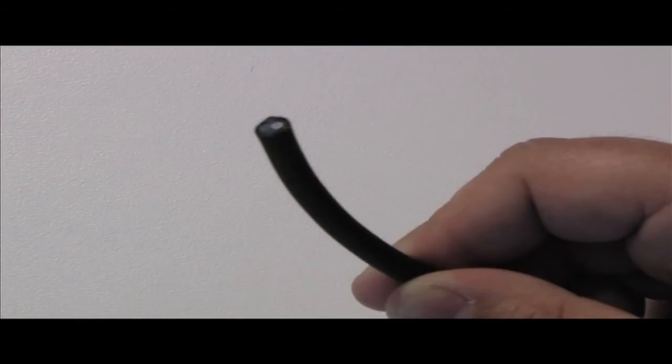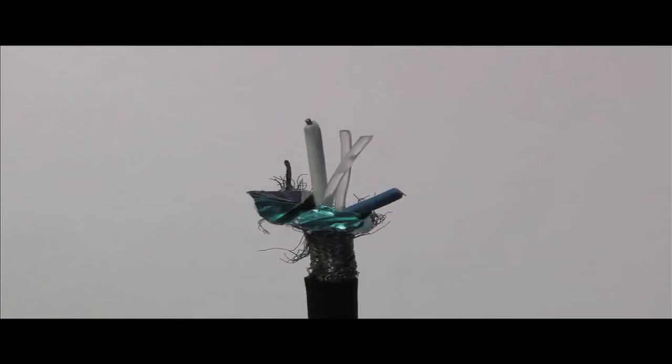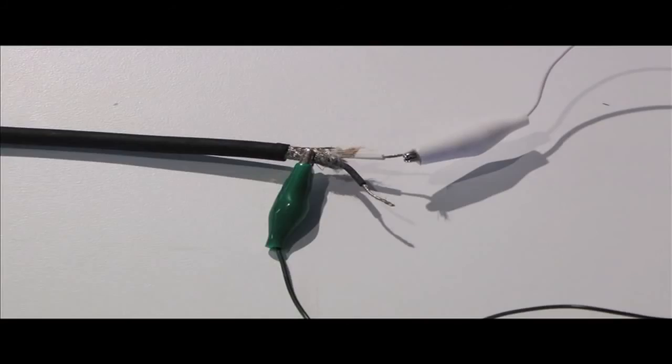Using wire cutters, first cut off the female connector of an XLR cable. Then, strip the outer part of the cable off to reveal 3 different leads. 2 are coated wires, and the last one is braided around those 2. On some cables, there may also be some extra material to reinforce those wires. Cut off that material and ignore one of the coated wires. We don't need it for this. Finally, strip the colored lead and attach one alligator clip to the braided wire and another to a bare wire lead. Your cable should look like this.